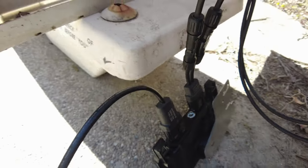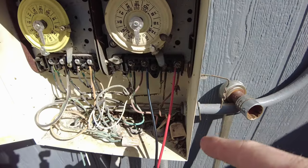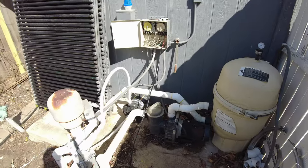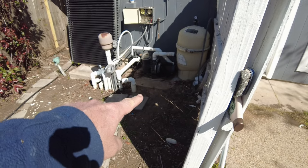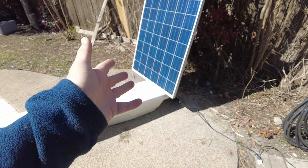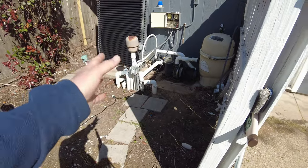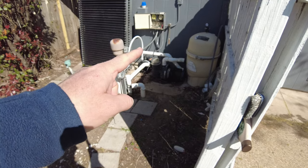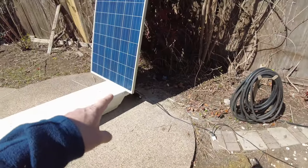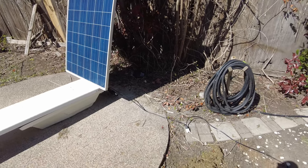What I have is this hooked up via the trunk cable temporarily into my pool pump timer panel. If you hook it up this way, it'll produce power from the panel only when the timer comes on to run the pump. The main pool pump runs about 1,500 watts, so we're well below that at maybe 300 watts max. The pool pump will use up all the power generated by the micro inverter, not even trying to export it to the grid. When the timer turns the pump off, since this is wired in on the back side of the timer, the micro inverter will go off as well and not export anything to the grid — something to think about.